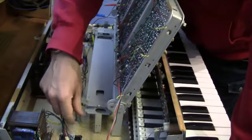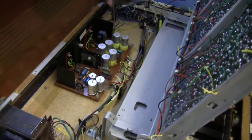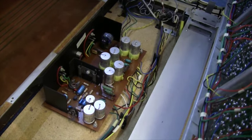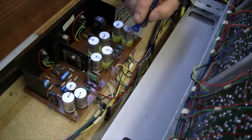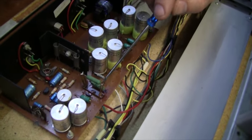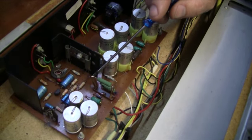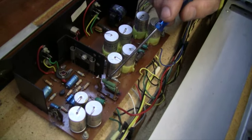I'm trying to figure out what's going off here. The power supply looks well used. Some of the resistors have been cooking for a long time - they're actually burning the board underneath. But it still works, it's still running. Here's a clever little device: this is a resistor, but it's soldered onto two pieces of metal that are spring loaded. So if it gets really, really hot, it actually unsolders itself and the spring pulls it apart, disconnecting it. It's like a little safety device.